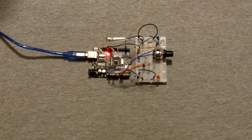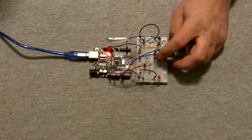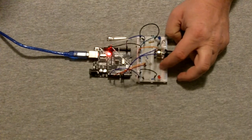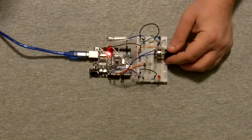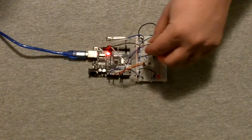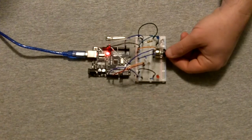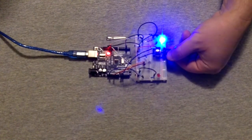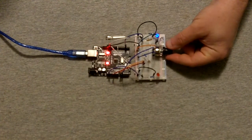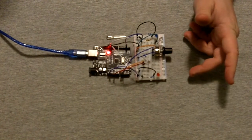So anyway, getting back into what I was working on here, I wired in this potentiometer. This is not part of the lesson, mind you. It's got 3 legs on it, and each of the legs are spread apart to where they fit into every other socket on the breadboard. So instead of fitting into numbers 1, 2, and 3, it fits into, let's say, 1, 3, and 5. So from there, I was able to branch out. I put 5 volts into one side, ground to the other, and then the variable voltage to the analog. And then I made some logic so that when I turn up the knob, you see the nice blue LED light up, then the red LED lights up, and then the other blue LED lights up. Then we go down, blue to red to super bright blue to off. Nothing crazy, just a practice.